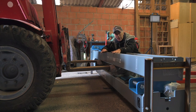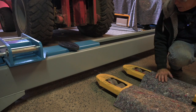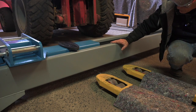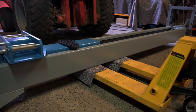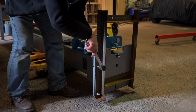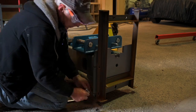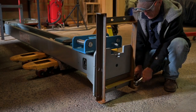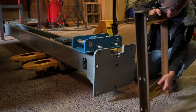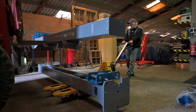You might jiggle a bit up and down with your forklift or whatever tool you have so that the bolts come out very easily. To remove the fixtures from the bottom pillar we do exactly the same, but now I'm going to use a pallet lift to lift up the bottom column so I can undo the bolts on the fixture. We've got all the support brackets removed, so now we can pull out the bottom pillar.